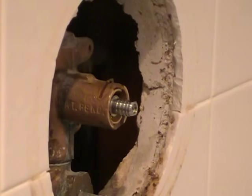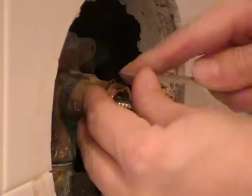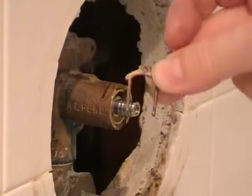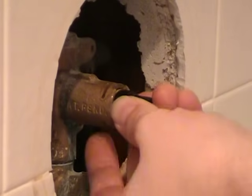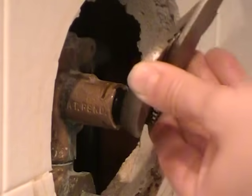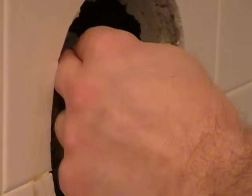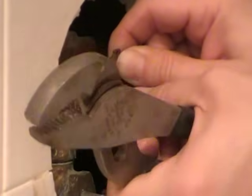Turn the water off first before we do this. Okay, before I pull that pin, make sure I turn the water back off. I need to pull, I'm sorry, the clip. I call it a clip, whatever it is. Pull this out, and we're going to get the plastic tool, which came with the new cartridge, which I said before sucks, but it's actually useful in this application. We're going to turn this 180 degrees. Let's see if it's lined up properly to get the clip back in. And don't lose the clip inside the wall. Just be careful when you're handling it.